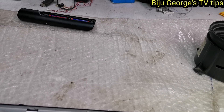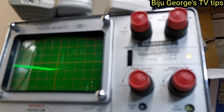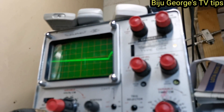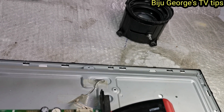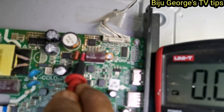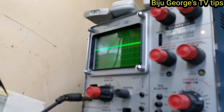Okay, I am connecting first to the 12-volt line. See, there is big noise. I will try to repair this — the 12-volt or 24-volt backlight voltage line. This one looks okay, only a little noise. See, there is a strong noise. You can hear it — it is SMPS noise.